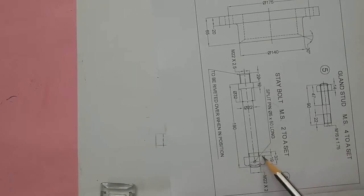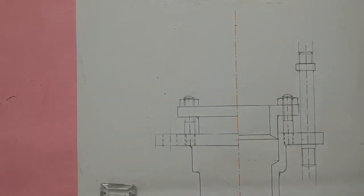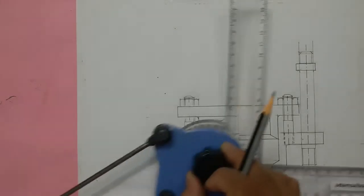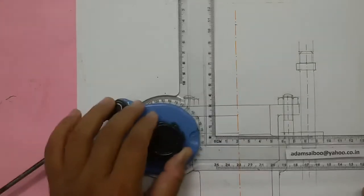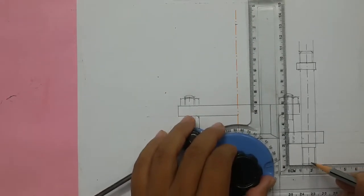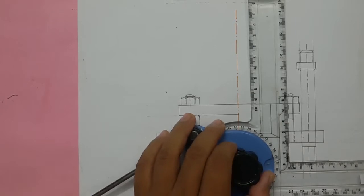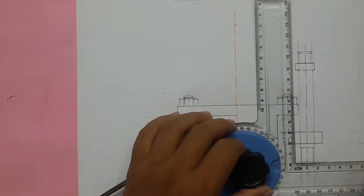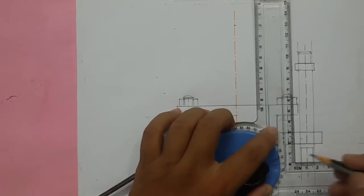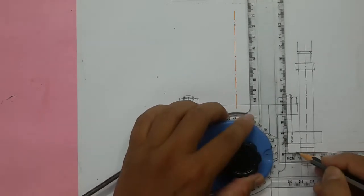You can see a nut over here whose thickness is given as 19mm. It is assembled with approximately 1mm clearance, so the nut will come just over 1mm above — draw a line there. The thickness is 19mm, so for us 9.5mm; mark 9.5mm from here and draw another line.